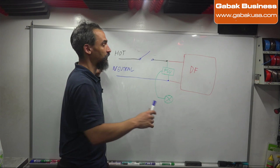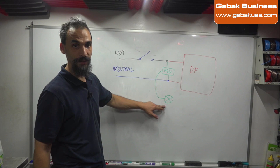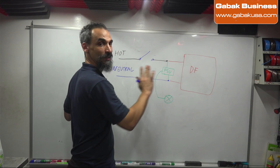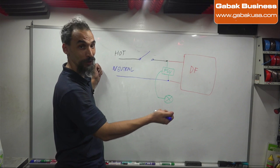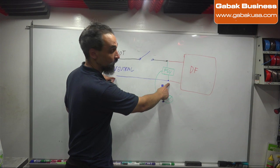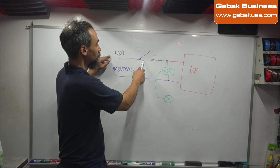Here's the theory. You have the defogger inside the mirror, and then you have the power supply, which is what powers the LED light. What you need to do is put them in parallel — that makes things easier. Once you've done that, you connect the wire coming from the 110V (if you're in the US) straight to one leg of the power supply and to the defogger.